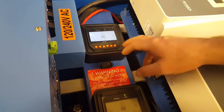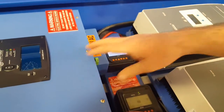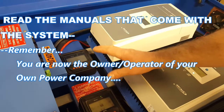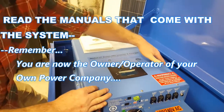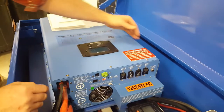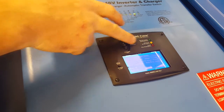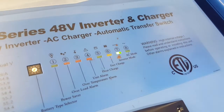We recommend reading your instruction manuals on the charge controllers and the inverter so you're well versed in any warning lights and sounds you might encounter, so you're not scrambling if anything like that happens. This is your inverter — it's 174 pounds, pretty heavy. If you want to get things going, you flick these two switches on here, those are the only things you've got cables plugged into. Then up here you start and power on the inverter itself. You'll hear a slight hum — that's good. All three lights will light up, and then the yellow one will stay on, which means your inverter is on. Mode seven is inverter mode, and that's what you're in.